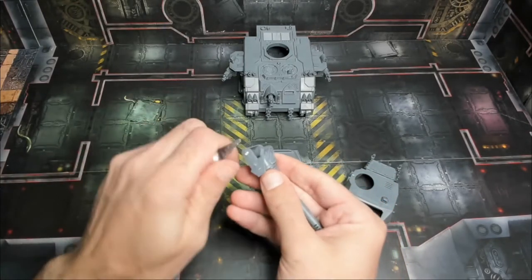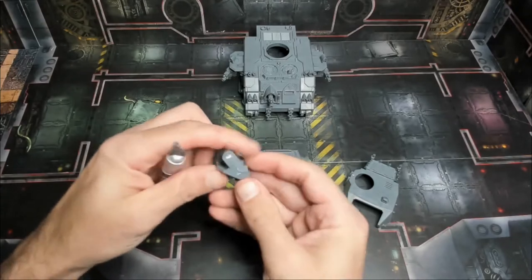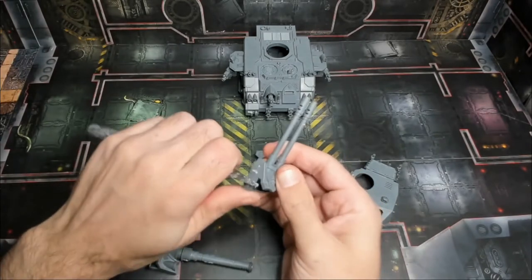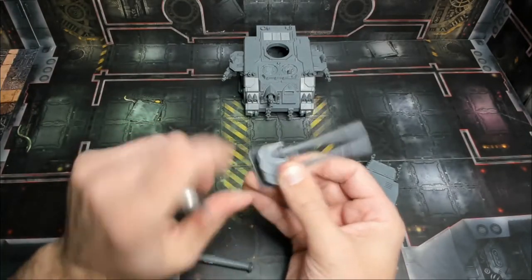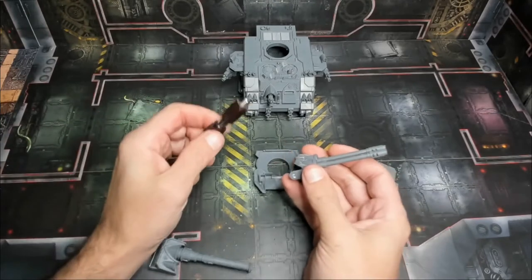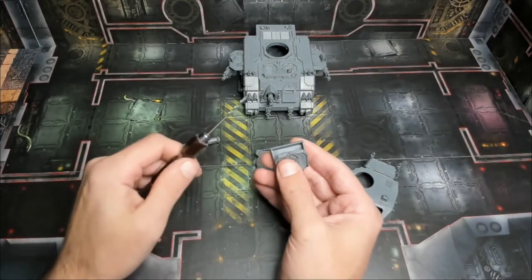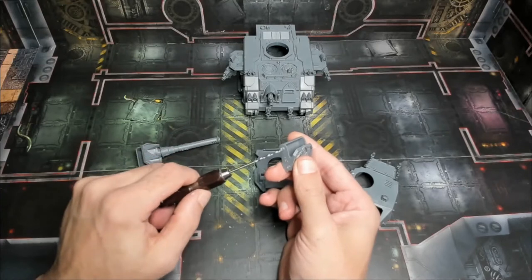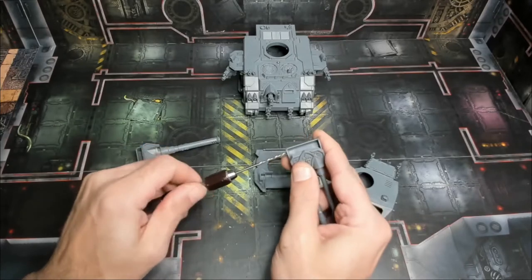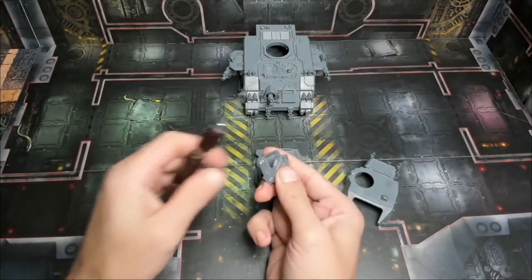We do want to just clean up this edge just a little bit to get a relatively flat surface for our drill bit, which is our next step. It does not need to be perfect right now — we just want to make sure we can get our drill bit where we need it to be. Next, I'm using a little hand drill right here; this works very well for your pilot holes. All we want to do is take a look at right where the old mounting point was and drill a little pilot hole right there.